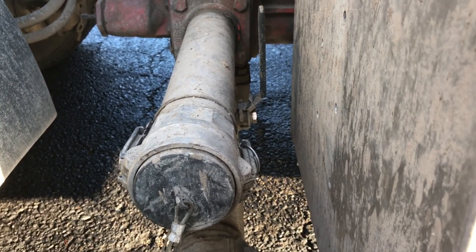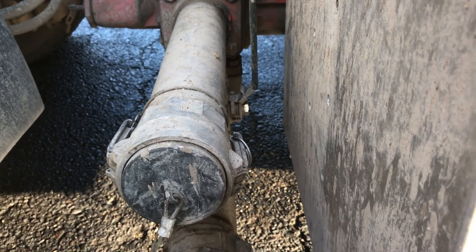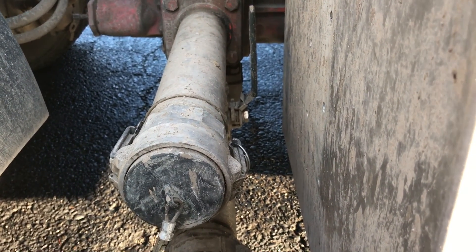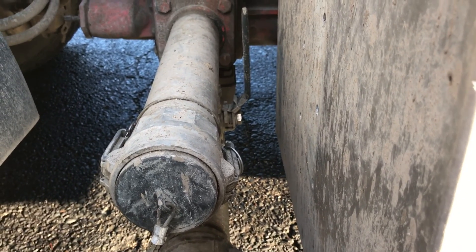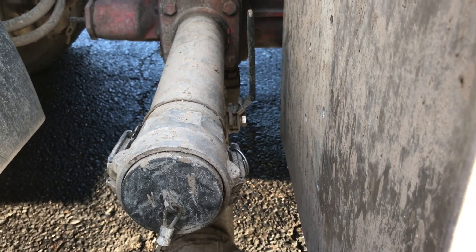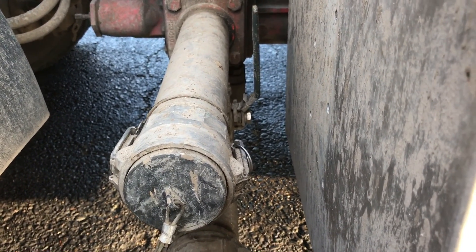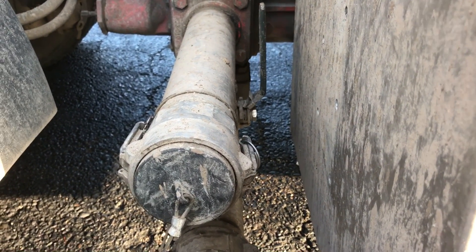When I first started, I was running my pump at 900 RPMs. The PTO on my truck is a 1-to-1.2 ratio, so it's turning out 120% of what the RPMs say — meaning at 900 RPM it's actually running a little over a thousand. I found that was too fast. Lesson learned: I now start pumping at around 700 RPMs. My truck idles at just under 650, so I want to get it up and over in case there's a product surge that bogs the motor down.